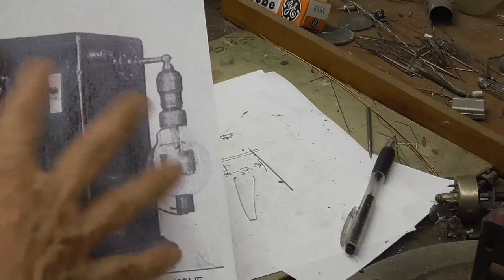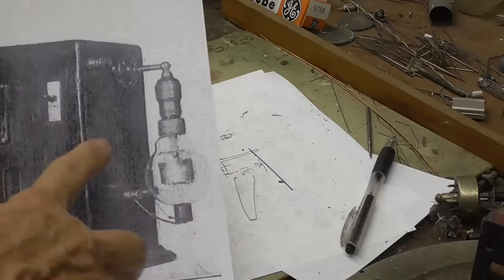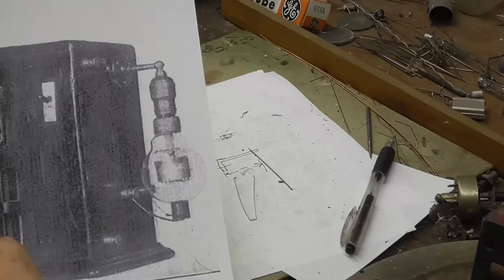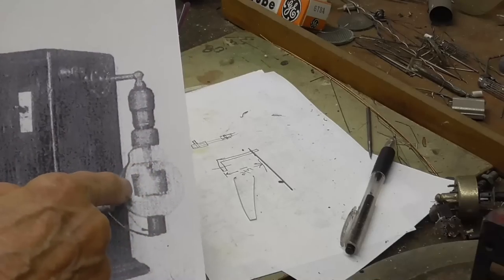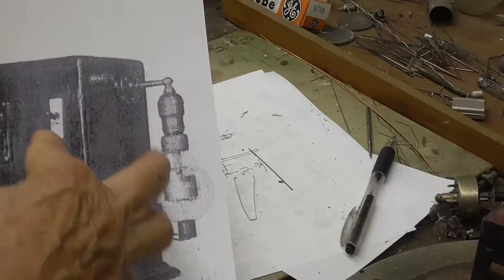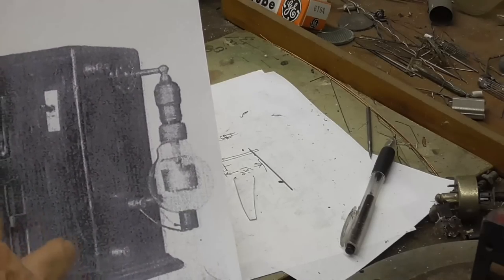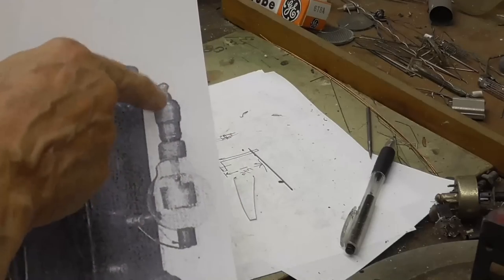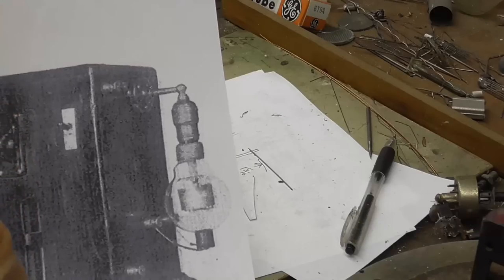And it's basically in the same scheme as a spherical audion. It's a little bigger, it's 2 1/4 inches in diameter, which is just a little bit bigger than a standard audion, and has much bigger plates in it, and a much bigger grid and filament in it, made to where it can take a little bit of power. So we're going to go ahead and duplicate that exactly. It looks like it fits in the standard audion type socket, no trouble.